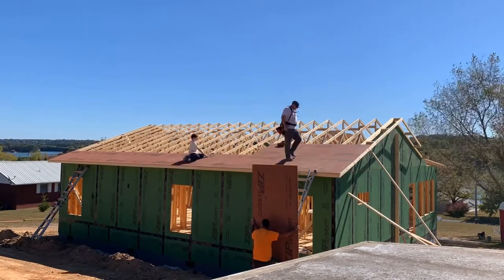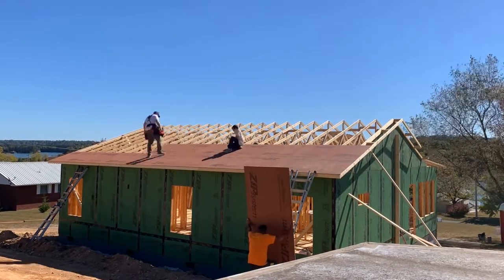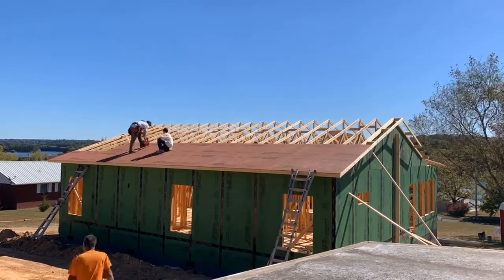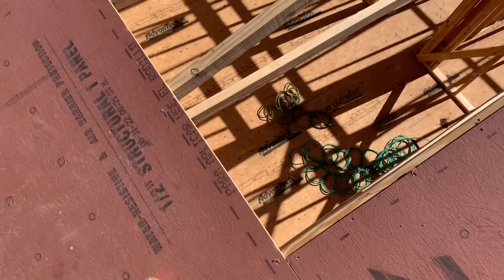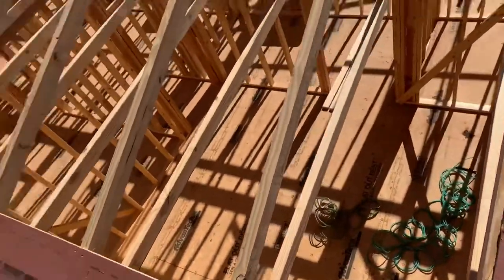Let's take a look and see how we do. On this roof we are using the half-inch ZIP sheathing. It is a structural sheathing, so no H-clips required between sheathing material. Typically you would have an H-clip in between each truss to help give each panel some structure to it, but because this half-inch is able to span that distance you don't have to use the H-clip.